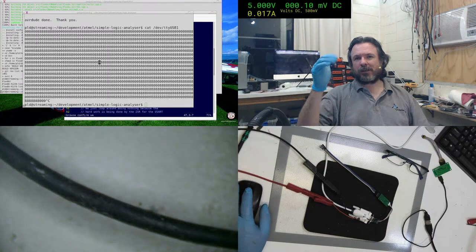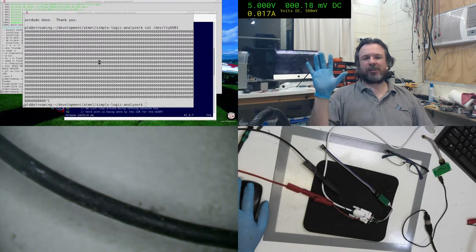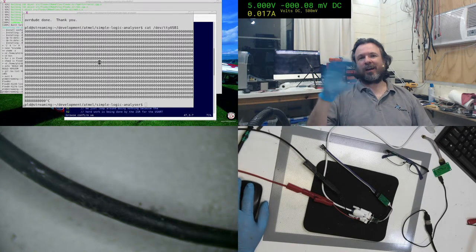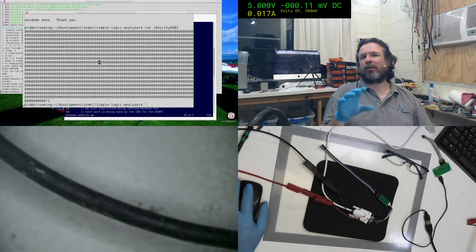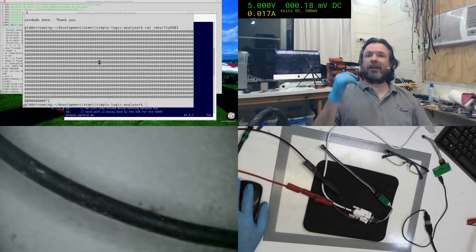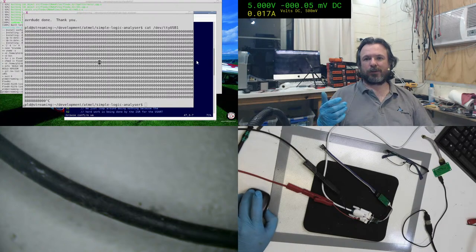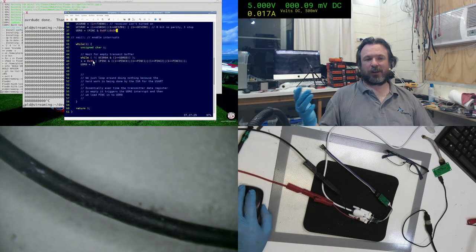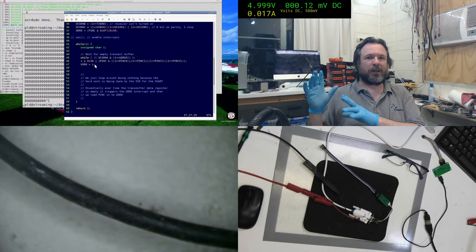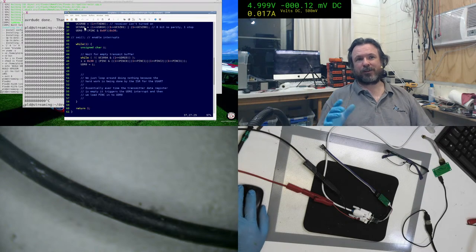The problem isn't the pins being sensed. Regardless of whatever is in pin C, the byte pin C, what's going wrong here is that when we try to load it into the USART output register, as in, the data that's going to be transmitted, it's getting there one time, but then with the next byte that's been sent out, it's not getting there. Whereas when we load it with a fixed value, it's fine. It gets there every time. So it doesn't matter what data we're getting out of pin C. The problem is that it's only showing up every second time rather than every time. That's the problem.